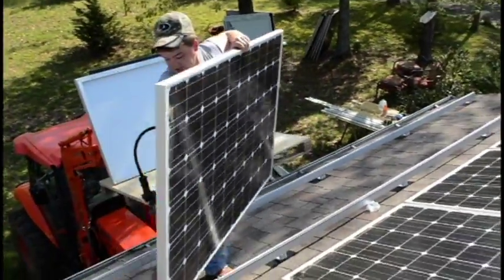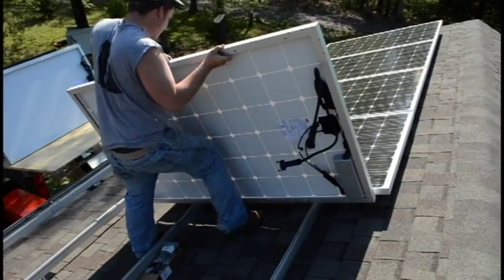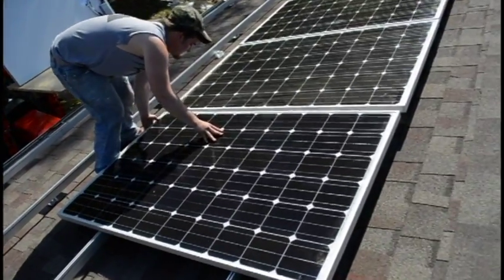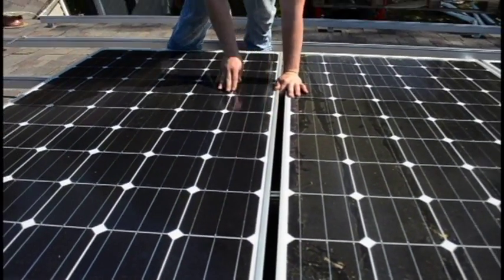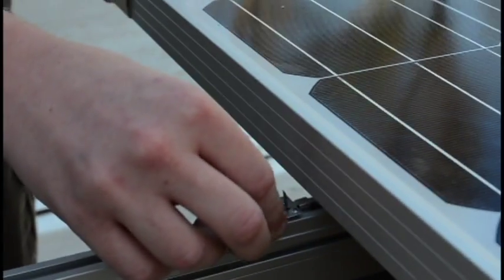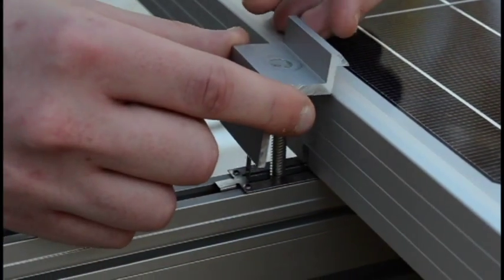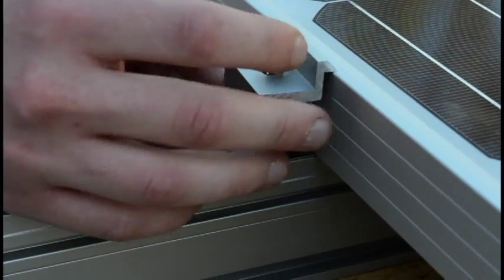Let's place the modules on our array. Our rails are secured to the flashing and connected by both splice bars and bonding jumpers. Place the module in the corner in line with your installation array plan. Make sure you center the module symmetrically on the rails — approximately 25% of the module should overhang each rail, and 50% of the module should be between both rails. Now end cap the exterior protruding cable and clip it securely in place. Leave the interior protruding cable as it will be connected and clipped when we place the next module. Secure the first module with end clamps since it is positioned at the end of a rail. Make sure the UGC-1 grounding clips are snug with the rails, and that the nibs seen here penetrate the rail when the end clamps are secured.